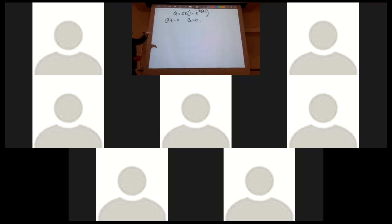My exponential then is going to asymptote to the maximum value. The maximum value is going to occur when time goes off to infinity. So then let's look at as t goes to infinity, I have e raised to the negative infinity. Well, what's e raised to the negative infinity? That's the same thing as 1 over e to the infinity. What's e to the infinity? Infinity. What's 1 over infinity? 0. So as time goes to infinity, that second term goes to 0, and I'm left with simply CE,